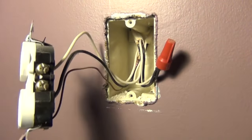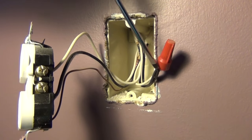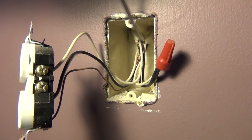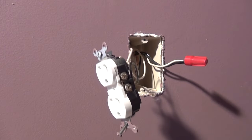That will clean everything up on this outlet and be a better way to secure all the cabling in the back of the box. Similarly, we're going to take our two hots and the current hot that is the return from the switch, connect all three together under a wire nut, and also provide a jumper from that wire nut over to the outlet to give it 120 volts. So both the neutral leg and the hot leg in this box will have four wires on each wire nut with one jumper going out to the outlet. What we've just done is killed two birds with one stone: we've supplied a hot and a neutral up to our switch for the new lighting circuit, and we've also given this outlet constant 120-volt power — it will no longer be controlled by the switch.